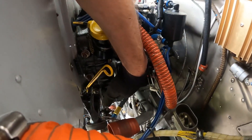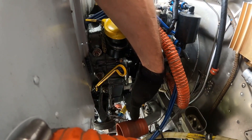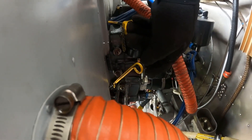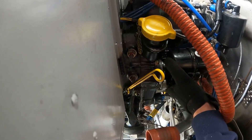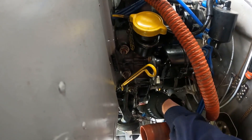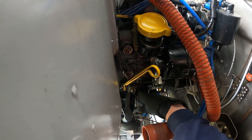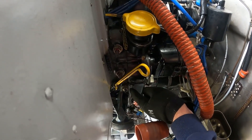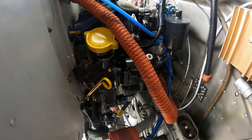One of the deviations done previously was when you put this together last time, you actually cut the gasket because it went down into the oil pan. You can remove the oil pan without taking the accessory case off, but you usually destroy that half of the gasket when you do it. So you have to put a new gasket on the oil pan and cut an original gasket to do just the bottom part. But when you cut a gasket, as Bill Global says, you're asking for trouble — and the trouble is called an oil leak.